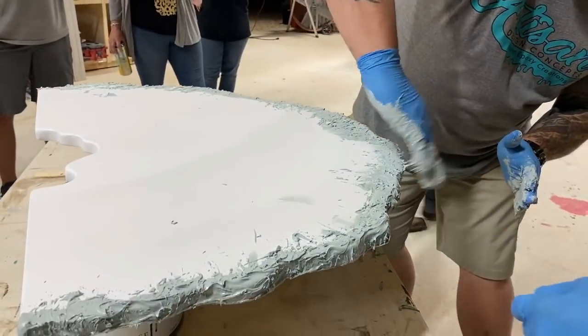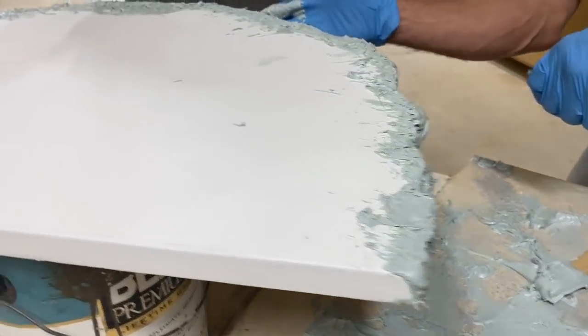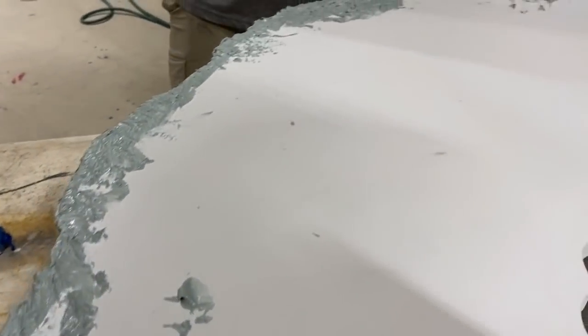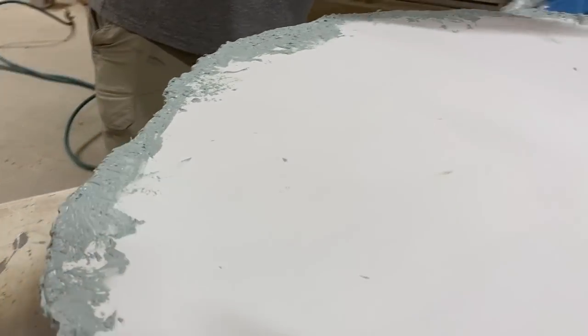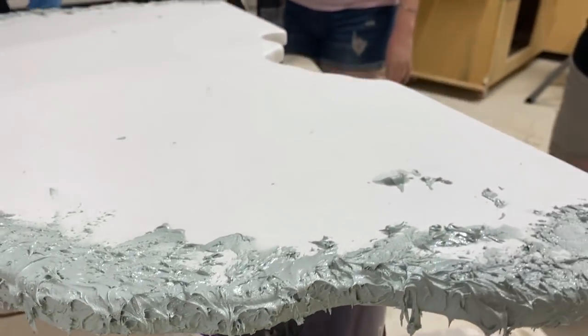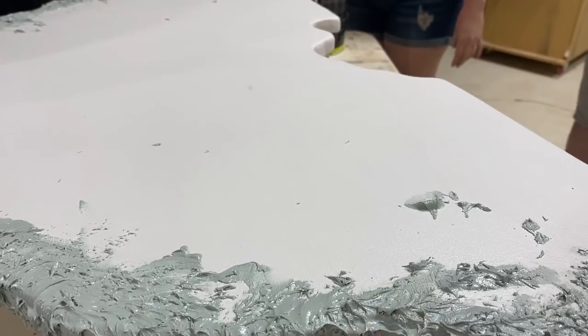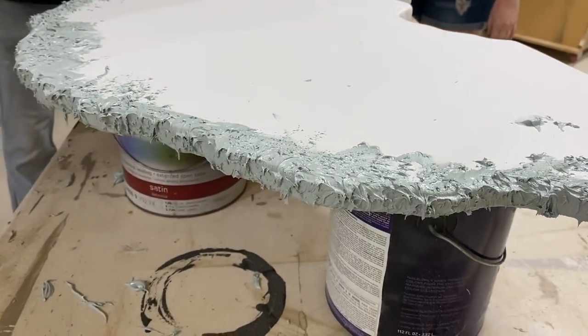Nope. For countertops, he always does two coats. Only because on a countertop, I'll do two applications, because the way I like it is I'll have that first layer out and let it set up, and then as it starts to rubberize a little bit, I'll slide my hand over so it starts pulling that up, and it'll look very textured, like a real stone.